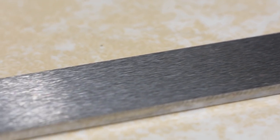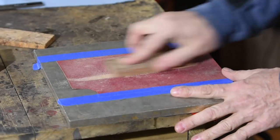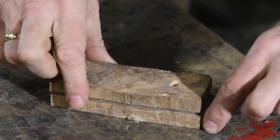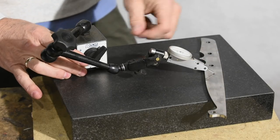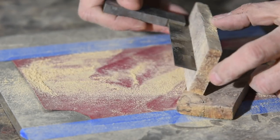Flatness is another really important issue, particularly with the handle of the knife. If you're buying precision ground steel, it's pretty rare that you'll have problems with flatness of the knife itself — the inherent flatness of the steel is going to be pretty good. The main issue is how flat the handle material needs to be. Again, the main check is visual: if there's a gap between the tang and the handle scales sufficient to see, you need to tighten it up. You can use engineering tools like dial indicators, but really just hold the scales up to the light with a straight edge on top — if light gleams through, you have a gap and a flatness problem.